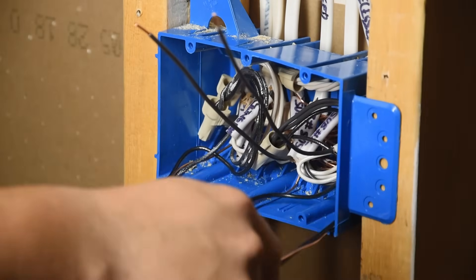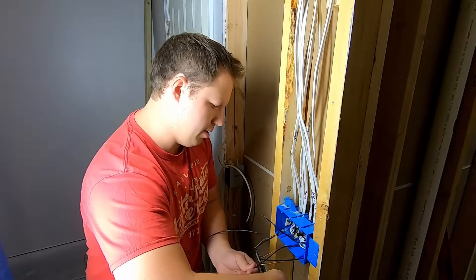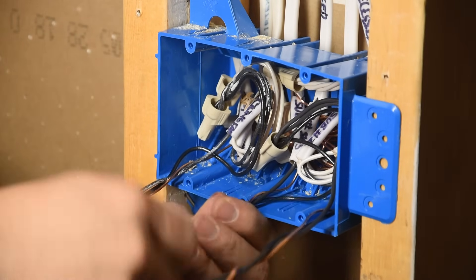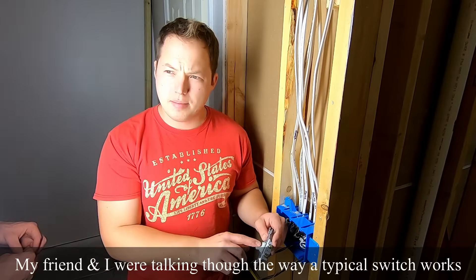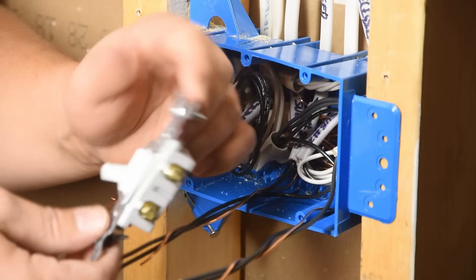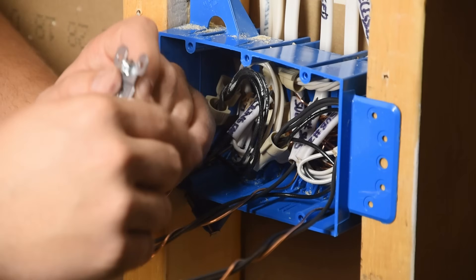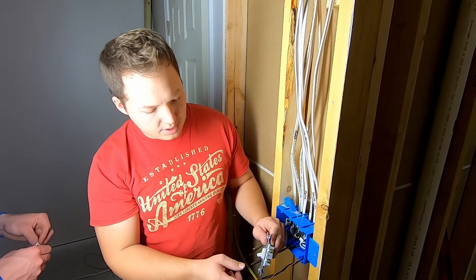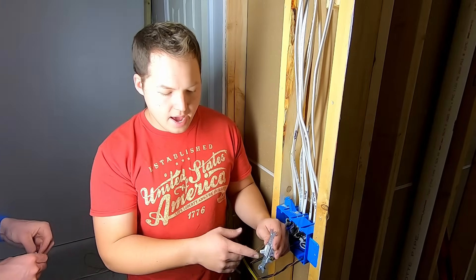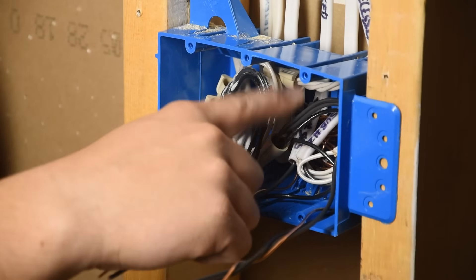Roll that back in. Now we have these two feed wires for each switch — snip off the extra, and wrap the ground wire around each set to indicate which wires go to each switch. With a single pole switch it doesn't matter which wire goes on which terminal. If you want to keep it uniform, put your feed power coming in on the bottom screw and the wire going to the cans on top — but it could go either way without affecting anything.